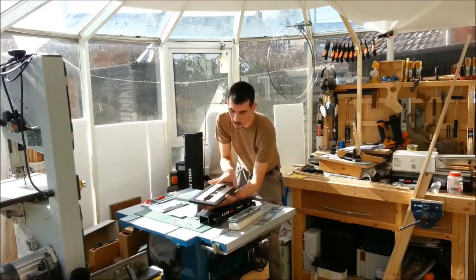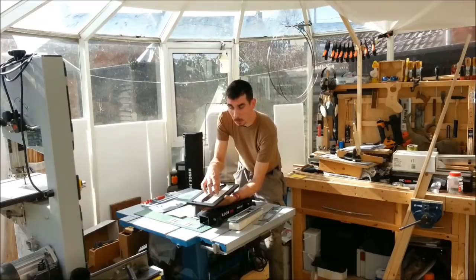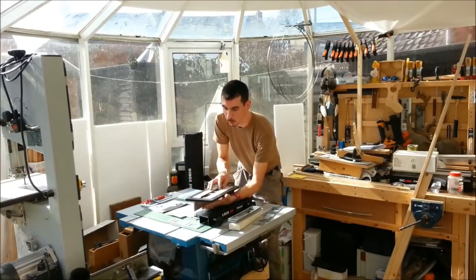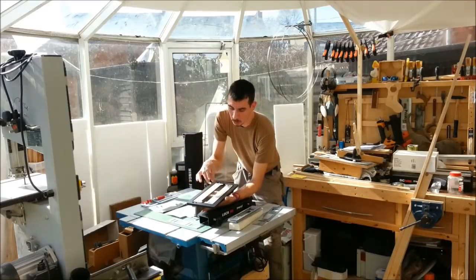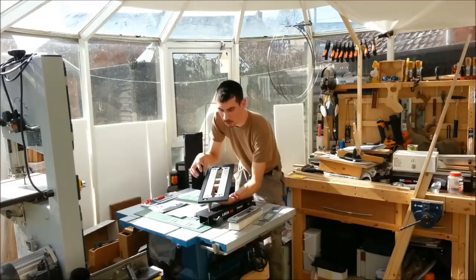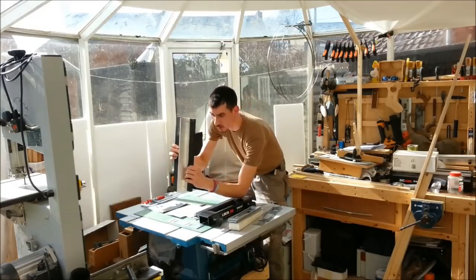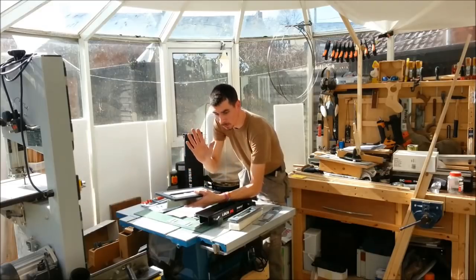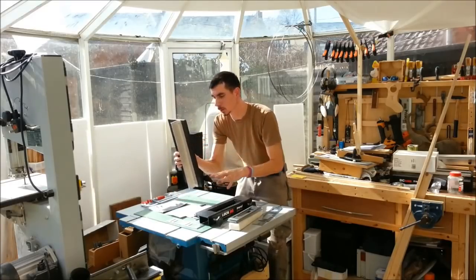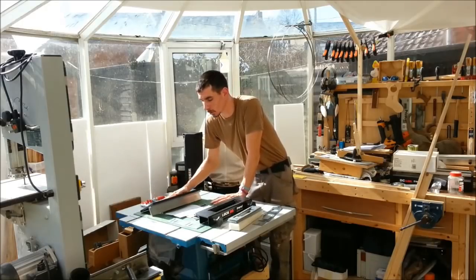With this one you've got to reset it, because it's all in the same jig. So you mark it out for the body, route the body, then readjust it for the plate, route out the plate. Then if you've got to move on to another door, you've got to reset it back. Or if you do what I did and you've got a number of doors to do, you mark out and route all the bodies first, then once the door's hanging you can go back and do the latch plates afterwards. You can't do it for the full mortise, but you only have to change the setting twice. That was one of my concerns before I used it, so it's something to bear in mind.